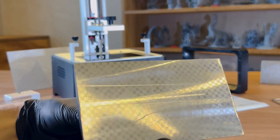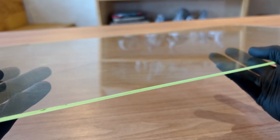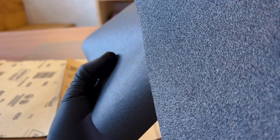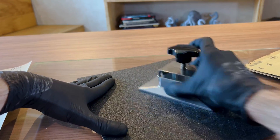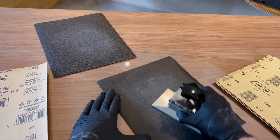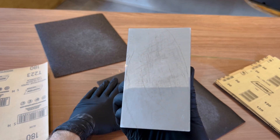Even some newer Anycubic printers already have a rough checkered pattern. Always ensure that the surface you are going to sandpaper on is flat, like a mirror or glass. Initially, use a grain 80 or smaller sandpaper to remove more material — make circular movements to both sides or even a figure-8 movement. Using water to sand, we can go little by little until realizing that the entire surface is sanded and even.